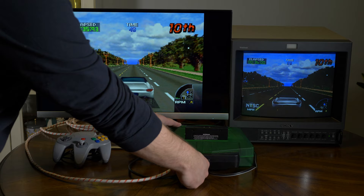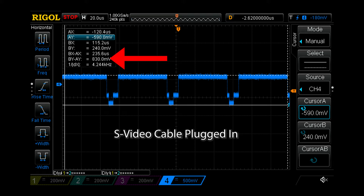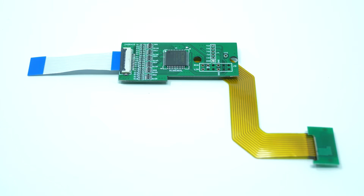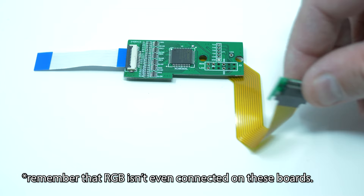Here's what the Luma signal looks like on an oscilloscope, proving there is a voltage drop when an S-Video cable is connected, which means that double the signal is being pulled from the chip — absolutely terrible for the chips in the N64. If you open the Warrior 64 and see the advanced kit, which looks different and has a second ribbon cable installed, you should be fine to use composite and S-Video, but I'd run the dual output test anyway just to confirm. Notably, nowhere in their Kickstarter campaign did they raise any concerns about using the analog outputs, and my guess is they genuinely have no clue how bad it is to split analog video signals this way — which is really weird because this should be common knowledge for anybody working in the retro gaming world.